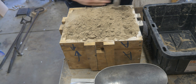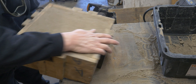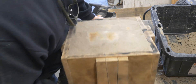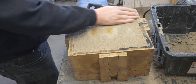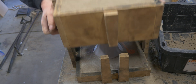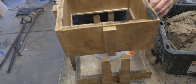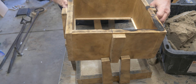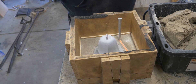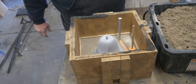We'll finish getting the drag rammed up and packed in there nice and tight. Get it flipped over again, and get the false cope taken off. Hopefully that pattern stayed in the drag — and it did. Now we've got our bell pattern in there. The inside of that bell is full of sand, so I've got a core built inside that bell shape. Go ahead and put our tapered sprue in, and the other half of our spin trap. There's a vent coming out — that vent will come all the way to the top. We won't see the metal actually make it to the top of that one.